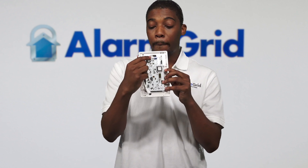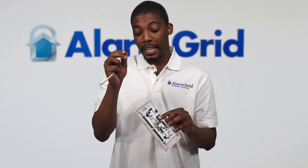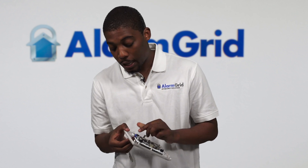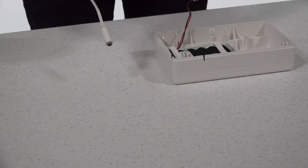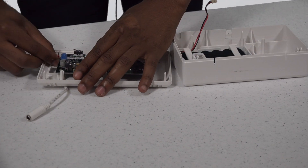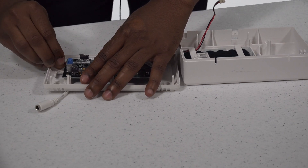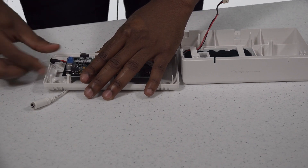To install the LT cable, you'll grab this end of your LT cable — the shorter portion — and you will plug in to the blue terminals. It is non-polarized, so you can enter one leg to either or. You'll plug in both legs by feeding through the back, and use a mini flathead screwdriver.